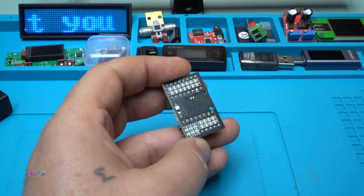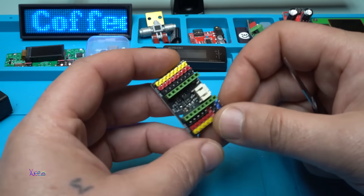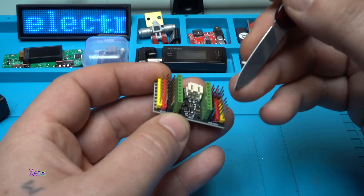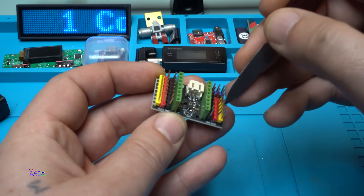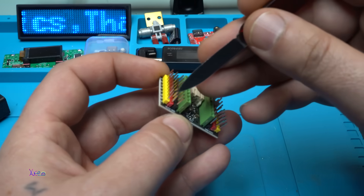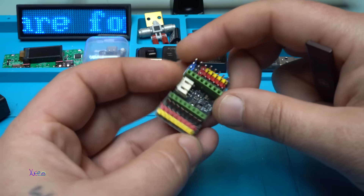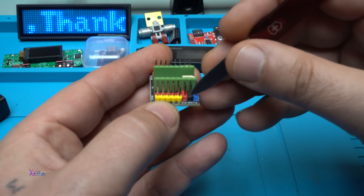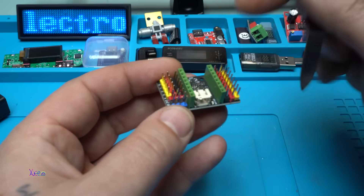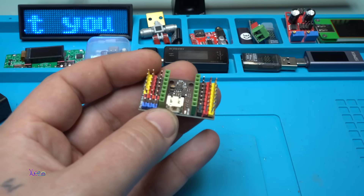Let me explain some stuff about this development extension board. Everything is color-coded: the black pin headers are ground, the red ones are positive 3.3 volts — remember that. The yellow ones are the pinouts for digital input or output — we have 13 of them. On this side we also have red for 3.3 volts, ground, and blue ones that give 5 volts. We also have a connector for attaching a battery, which is pretty nice.